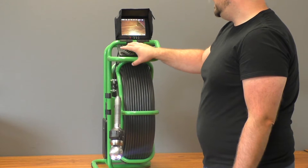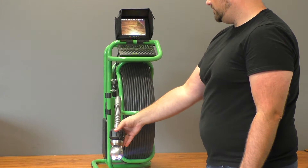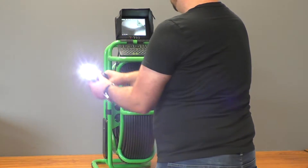To get rid of the self-leveling, you want to hit the iris buttons on the keyboard. You're going to go to borehole mode — it's going to turn the automatic self-leveling off. That way, if you move the camera unit over, it's not going to flip upside down.